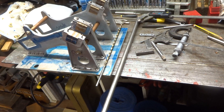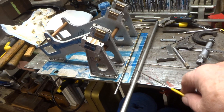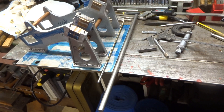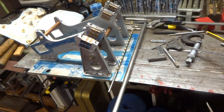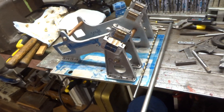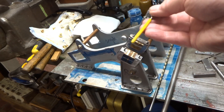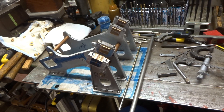The crankshafts for this paddle steamer engine are going to be made from a piece of 3/8th ground rod, 3/8th diameter. I'm trying to decide the best way of effectively drilling through all these bearings such that everything lines up both vertically and horizontally and everything is in the right plane without binding.